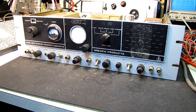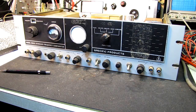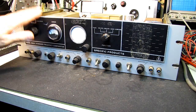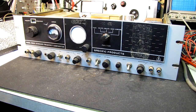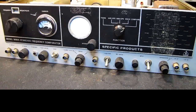Right in the middle of that my camera battery died — it had made about five videos and I hadn't been keeping an eye on it. I realize that wasn't a very impressive demonstration of reception. It's getting on towards evening; when I was using this earlier on the 10 megahertz band this thing was jumping off the table, the signal was so strong. It has just faded away. This receiver is rated at one microvolt sensitivity, which is pretty phenomenal. I checked my IC-746 Pro and could barely hear WWV on 10 megahertz — the signal strength was actually better on this old timer than on my new radio.